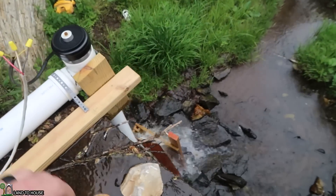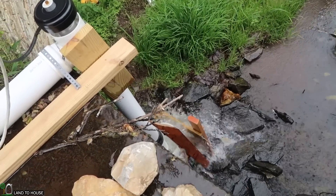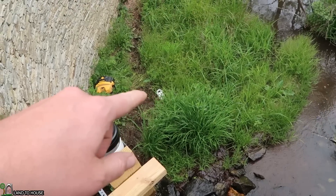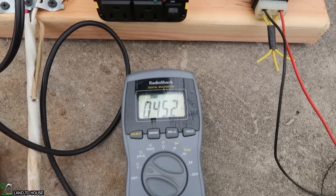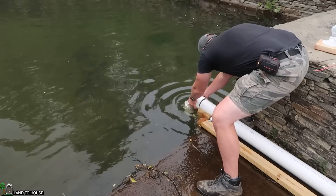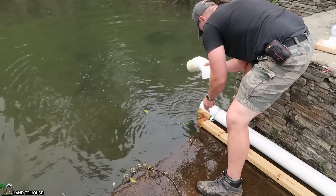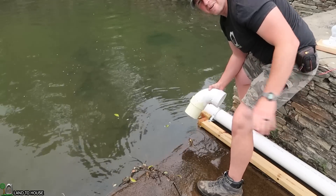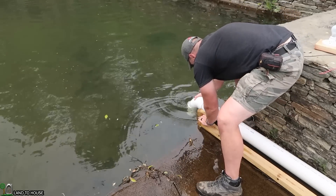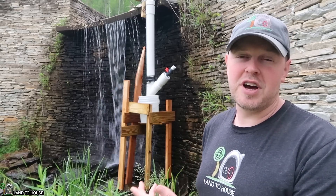That's with about a three-foot or so downpipe wide open. So the next thing I want to do is add those two reducers — let's do the three-inch and then the two-inch, and we'll see if that number decreases any. It's quite consistent, which is good. So with a straight 4-inch pipe down into the bucket, it's got an open circuit voltage of 45 volts.